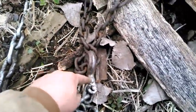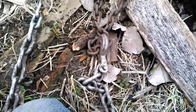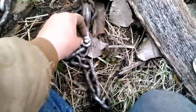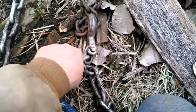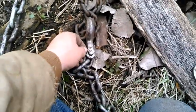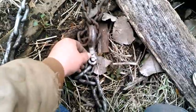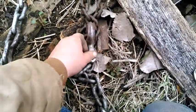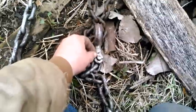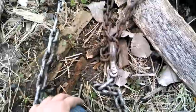I'm going to take this chain off and put it on the longer half of the one that was busted. But you always stand way off to the side. Lots of times it's safest to throw a coat or a blanket over it — that'll help reduce the danger if that link flies around; it could be caught by a jacket. Always pull low and straight so that if it breaks, it comes straight back here and shoots into that tree and underneath the tractor. That's about your safest bet.